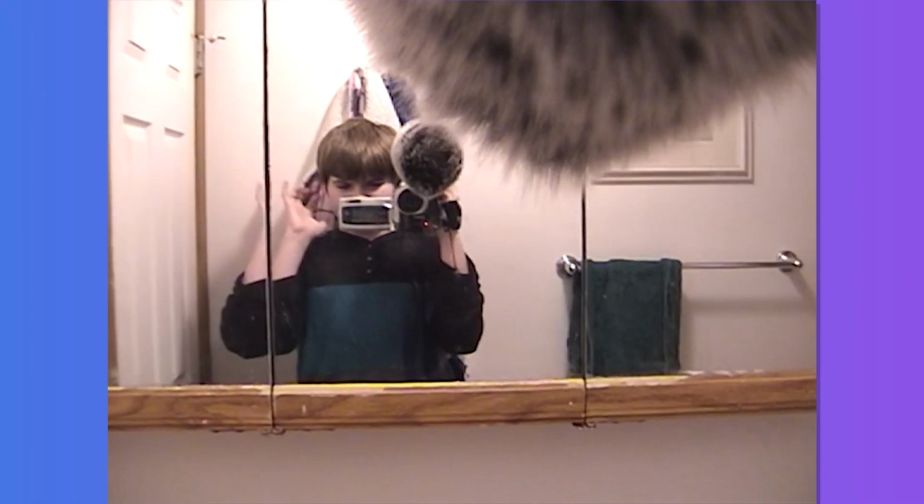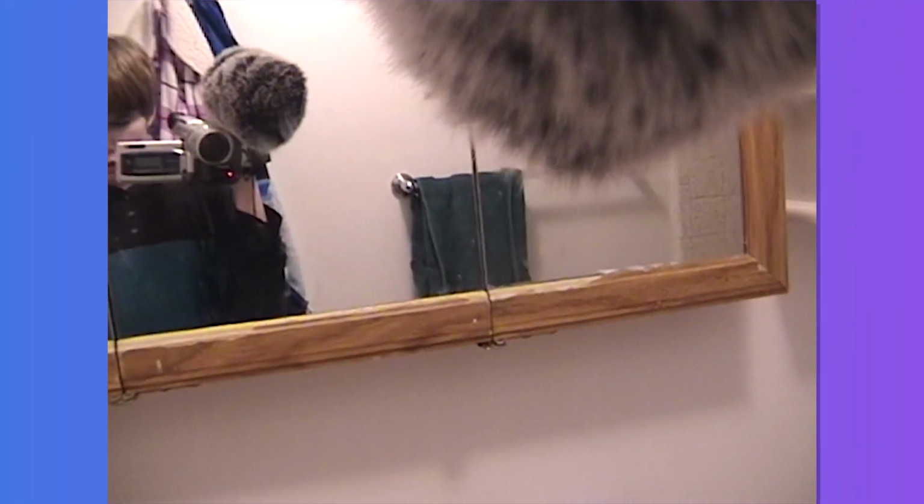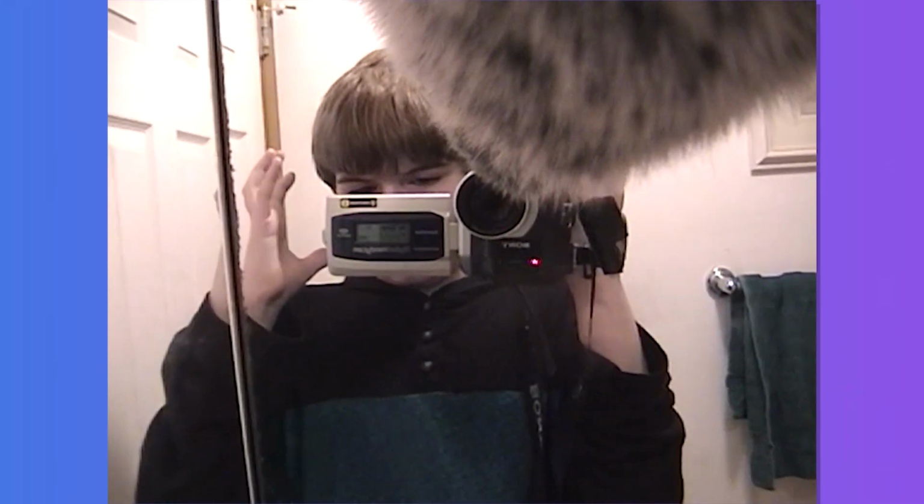Alright, this is Digital8 quality. This is coming off the camcorder, and what I'm doing is I'm actually plugging my Canon microphone, my Takstar, into the audio jack on here, and you're actually seeing uncompressed 16-bit audio, I think. It says 16-bit. I think it might be pulse code modulation, but yeah, this is it. It's running the tape 2 times faster, I think 2.5 times faster to get to the speed required to record digital video. And I think it's also doing a date stamp, which is actually stored separately. It's pretty interesting. So I'll be doing some tests, and this should be part of the video.